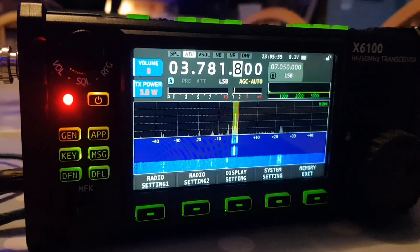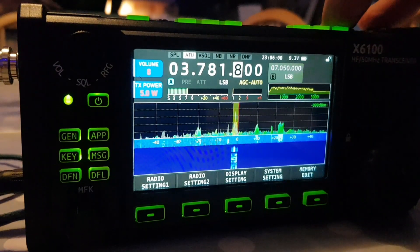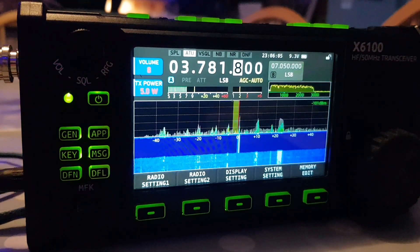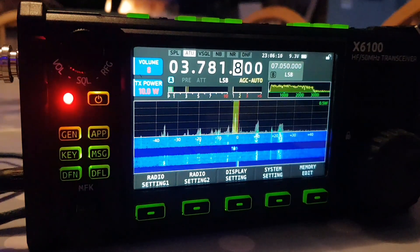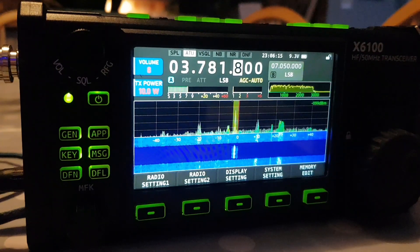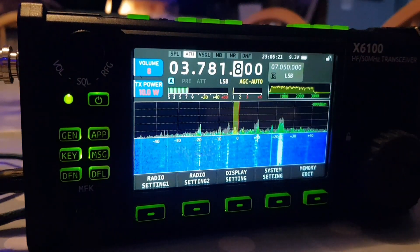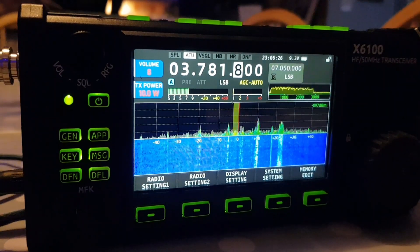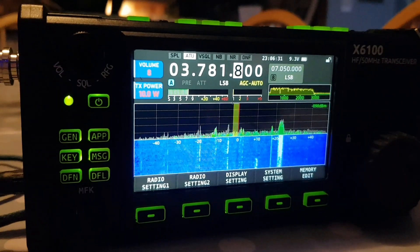It went back down to five, and I bet that's because the SWR isn't great. So if we tune it — there you go — and give it a whistle, we're on five going up to 10. That's a new thing we've learned: when your SWR is higher than probably 2, it brings the power down to 5 watts to protect the radio. 73, all the best. Thanks for watching — please like and subscribe to my channel if you find it interesting. Bye for now.